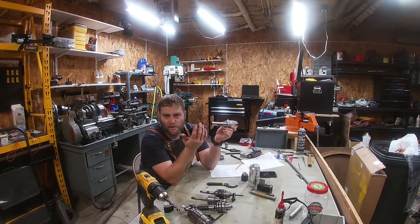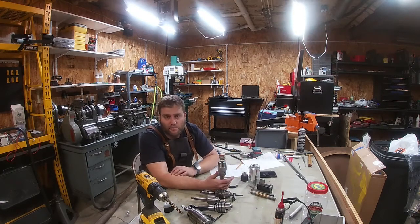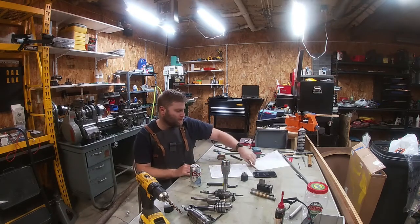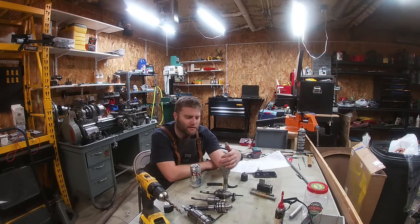I know there is some runout in my spindle — there just has to be, especially in a $2,000 mill. But I think I'd be hard pressed with any drill chuck in my mill to get any better numbers than this. If I wanted less runout, I would just use a collet. I don't know what higher endorsement I can give to a piece of equipment, especially one made in the Far East. Anyway, I hope you found this interesting. I wrote pages and pages of numbers, did a bunch of tests, and the numbers don't lie. My findings were surprising, but in a good way. If there's anything I could do different or better, please leave a comment. Otherwise, I appreciate you stopping by the shop. Have a good night.